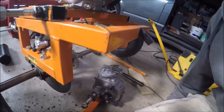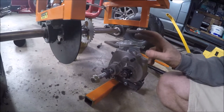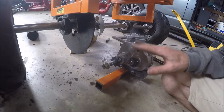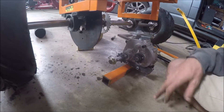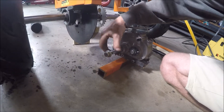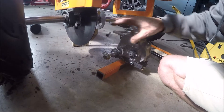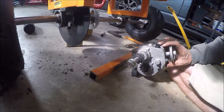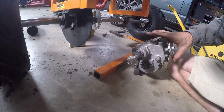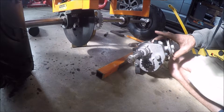It might be something that I do later, but just for now we're going to have a look at this. The orientation of this I think needs to be level like this, because otherwise your gear oil won't sit on the idling input shaft. If it's right up at an angle like this, I don't think that the oil will get to this one enough, which is a bit of a pain because it would be better if I could have this up like this.